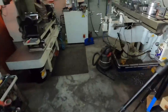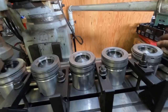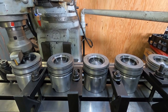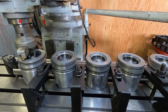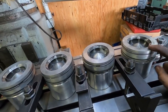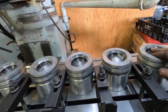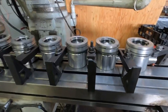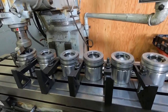Anyway, I've got a set of pistons here that we need to surface — these are 6.7 pistons. They're for Eric, who is building a 12-valve 6.7. He's trying to raise the compression, so we're going to surface the block and then surface some off the pistons to bring compression up. I've never personally done this before, so we'll see how it works out.